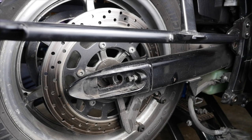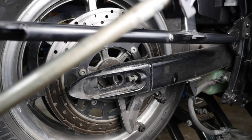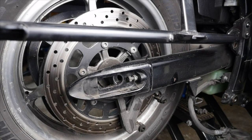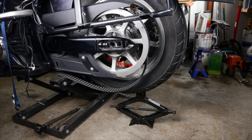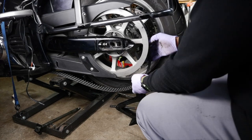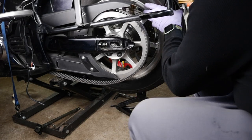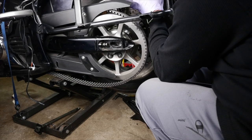If it binds or gets stuck, you need to either raise or lower the jack — just look at it and figure it out. Take your time. Once you get the axle out, let the wheel stay in there for a minute. The caster block is still on there, grease and everything is fine. Take the axle and lean it up somewhere safe. Now lower that scissor jack and just lower the wheel right on out.